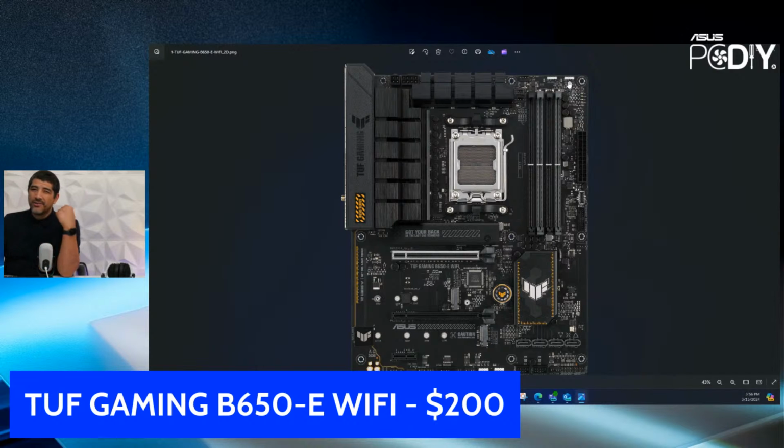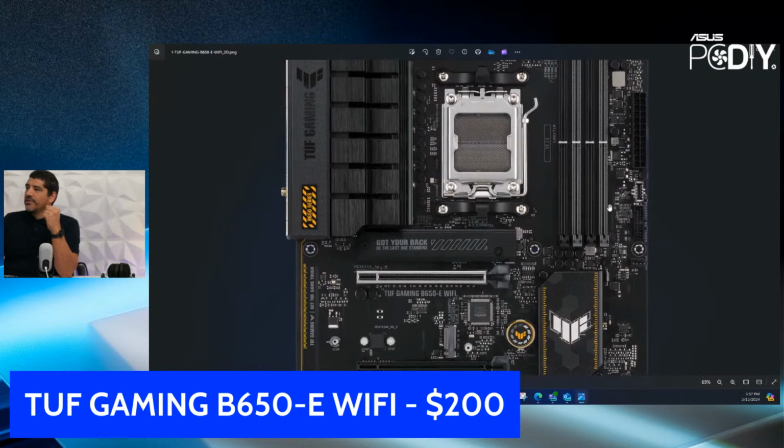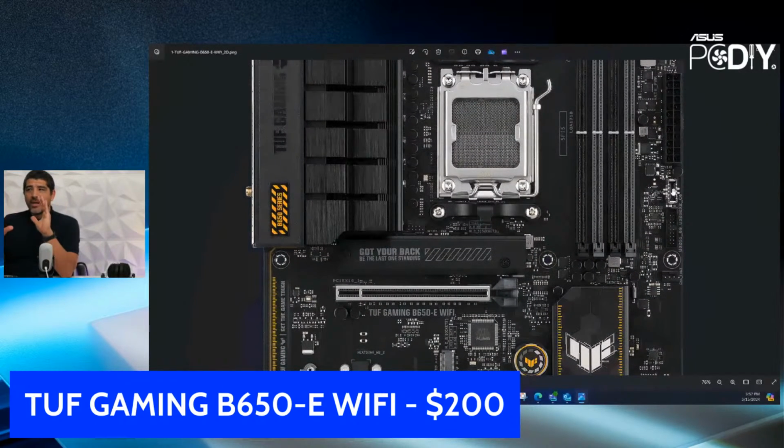So of course you can connect your AIOs, your fans, your chassis, your LED strips. For the internal USB-C, this is actually an upgrade. So we went ahead and we flipped the actual connector design. In the past, we've sometimes put 20 gigabits on the rear. We decided for this model to do 20 gigabits on the inside on the chassis. So this is actually a 20 gigabits connector. And then we still give you USB-C on this board, but on the rear, we're going to do 10 gigabits.